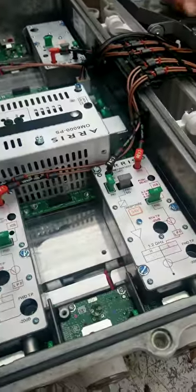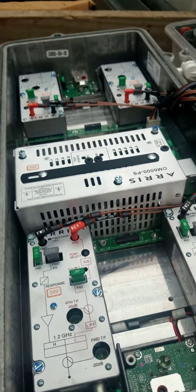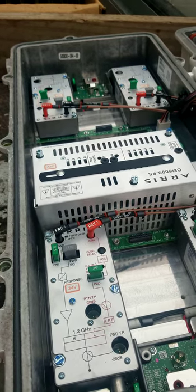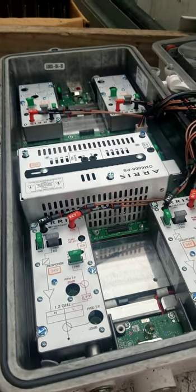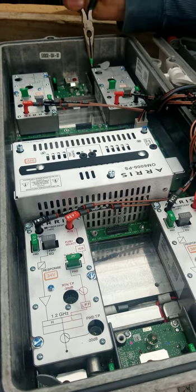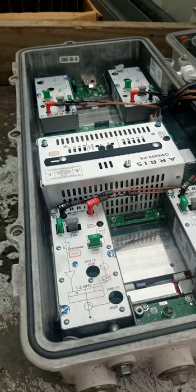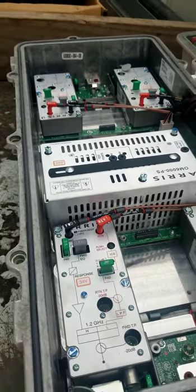So whatever power's coming in and you want power to go somewhere else, you fuse each one. They come automatically fused. If you don't like splicing with the power on, which I don't recommend, pull the fuses out so you're not shocking yourself while you're trying to splice. It's super easy to pull out. Get your little nose, pull right out. So pull those out before we do any splicing. Put them back, but keep in mind where your power comes in. If you have to splice a node, you have to find out which port's going to have power on it for your print.